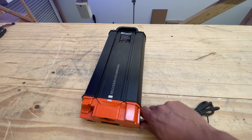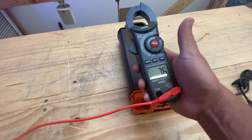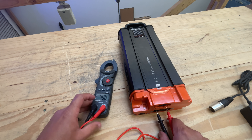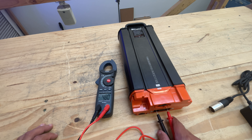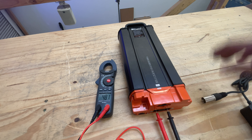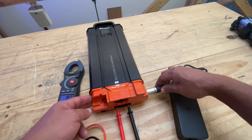First, let's see if there's voltage on this. Multimeter on DC power — it seems to be dead, or at least the BMS seems to be off, because it's only showing negative 4.81 volts. I had it backwards, so that's about five volts — not even five. Let's connect the charger and see if we can wake this guy up.